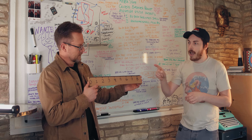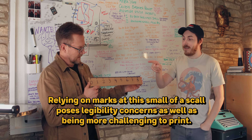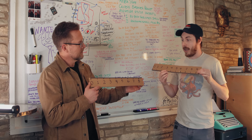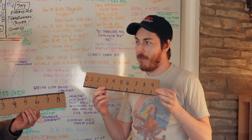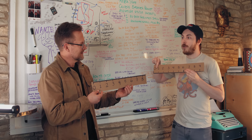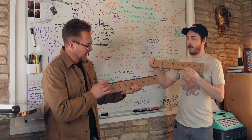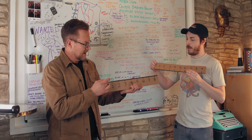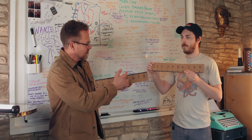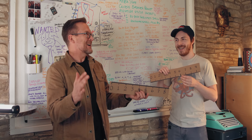So instead of guessing, Vernier figured out a really clever way of figuring out the tenths of a millimeter. In order to do that, he has a Vernier scale, which is almost the same — except instead of measuring to the millimeter, it sort of lies to you. Each one of these is measuring to 0.9 of a millimeter, or nine-tenths of a millimeter.